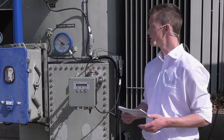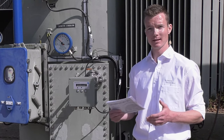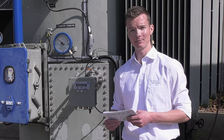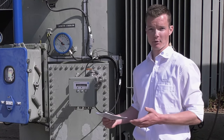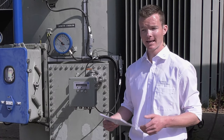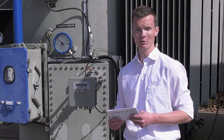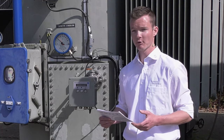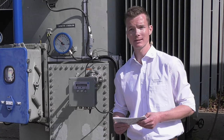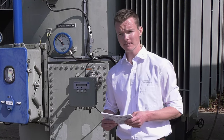The reason is we need a small crane for this replacement and we have to check the space around the transformer and around the substation. As I said, we need the crane for the replacement. In general, of course, the customer is responsible for health and safety rules: taking care of de-energizing the transformer and grounding and so on. The 5 safety rules, safety clothes, we will bring, of course, but general health and safety on site.